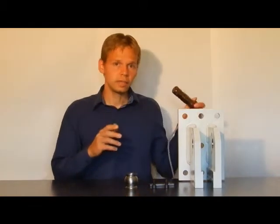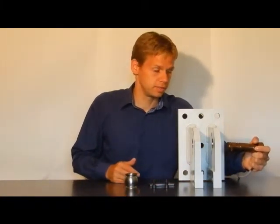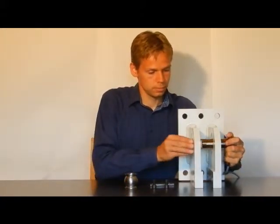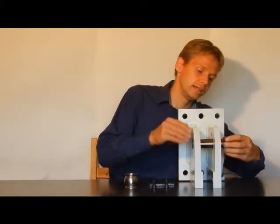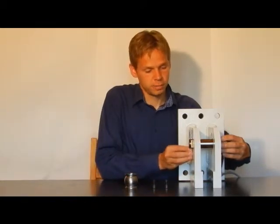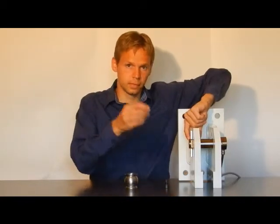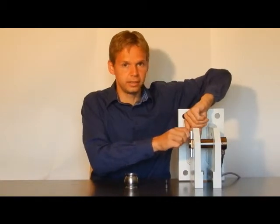Now for mounting the load pin. You have to put it into the application without any hammers or additional force — just place it in. What is really necessary is that the head has a little bit of space, and that the anti-rotating key matches with the application. This is the key plate. Use screws to fasten the plate, and that is all.